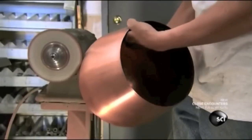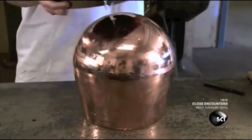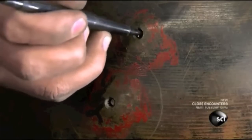At the factory, they make the helmet's head portion — called the bonnet — from a copper sheet about a millimeter and a half thick that's been spun on a lathe into a dome. They buff it smooth, then using a template, mark where to cut openings for the various components.